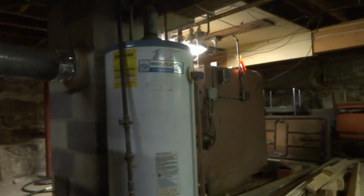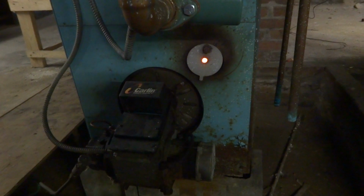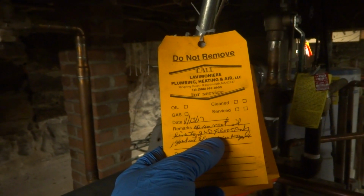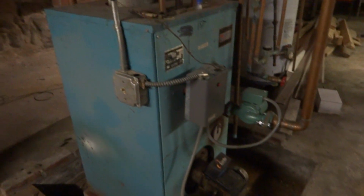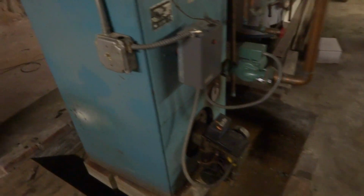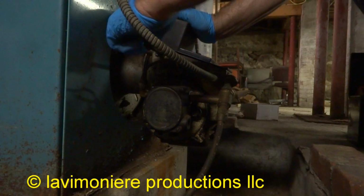This old stuff. Stack switch on that one. Just old stuff. Yeah, so one year ago I did connect the oil line to the second floor tank. Go to oil flow, new nozzle. Fired right up nice. We'll check the CAD cell, make sure it's not dirty, maybe clean the head. It's a Wayne burner. See, this pump here doesn't have a strainer, and that's a Webster pump, no strainer. Could be this transformer. I doubt it.